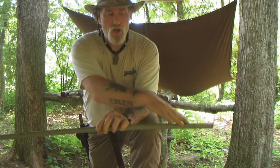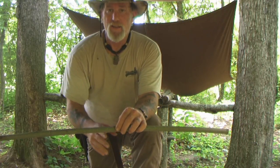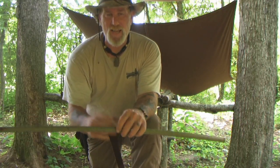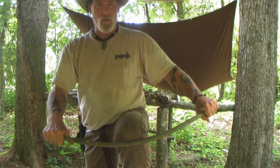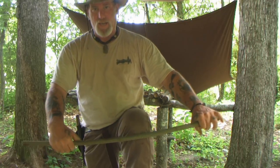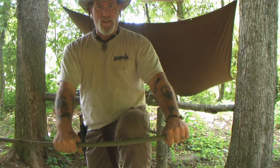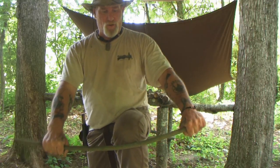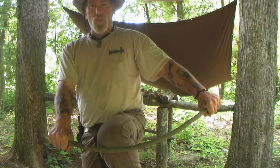We've got to factor how long the stick's going to be by how deep we want that brace height to be. And remember, that brace height dictates how big around the sticks are that you can process. That's the advantage of a bow saw over a bucking type saw, is that most buck saws aren't very deep as far as how big around you can cut a log without having to roll the log or roll the piece of wood.